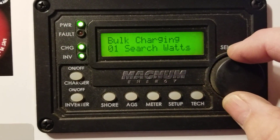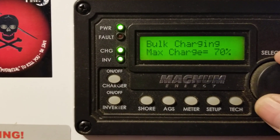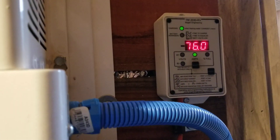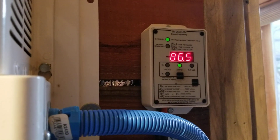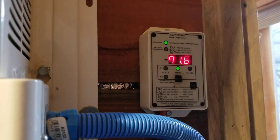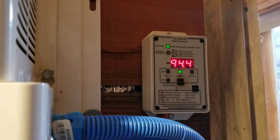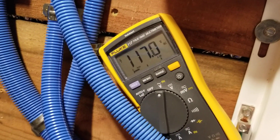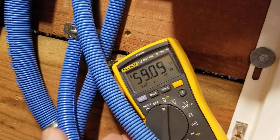Go back to setup — charge rate — 80 percent. And the fan kicks on by default at the higher charge rate. 94 amps. And I'm only sagging to 117 rather than 113. And the cycles are at 59. I can live with that most of the time.